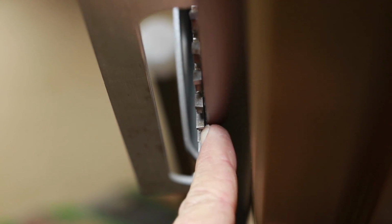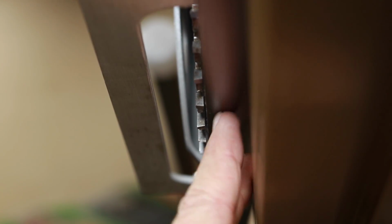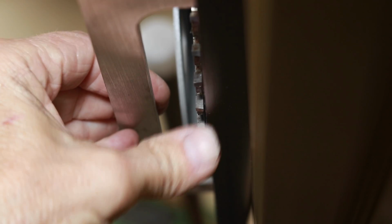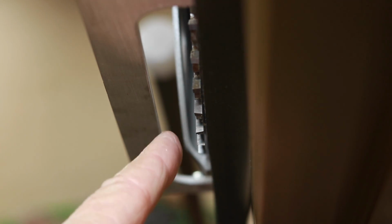We're good to go, or whatever you want to say. Don't know if it's going to pick it up or not, but I can get my fingernail right through there, so it's just off. And if I move this, it's not even scraping. Doesn't even come close. So that's not a true zero. Again, it's very rough anyway, so I think I'm just going to replace the edge, recut it to be a zero clearance to match this blade now, which I don't understand why it's not touching, because you're referencing off the back of this when you set it up anyway. So yeah, it just makes no sense.